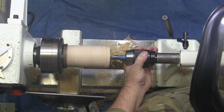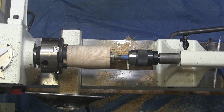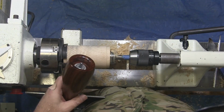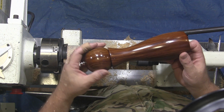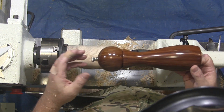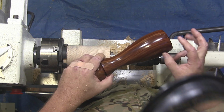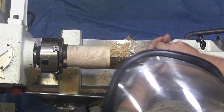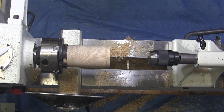Okay, now this needs to be a 1/2 inch. It needs to be a 1/2 inch for this bottom mechanism. This is deeper than it needs to be, but it has to be about a 1/2 inch, and that's just about what I've got there. So it can be as little as that. I have made them a little bit taller with a smaller mechanism. I've made this a little bit deeper because I've got a lot of body here, so that gives you some room for error. Again, make it easy. Okay, that's drill bit number 1. Yes, at least a 1/2 inch. And again, their instructions are good for the mechanism measurements.